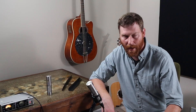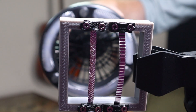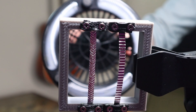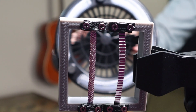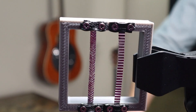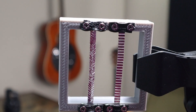The biggest way I can show this to you, I think, is inside of the test frame you saw before — we use these for drop tests. But you can see it most obviously with a fan. I'm going to pull up the frame here. When I put the fan behind it, you can see the regular corrugated ribbon really bowing out and flapping in the wind. Then the herringbone bends out some, but it's much more stable and doesn't deflect nearly as much — it's much more rigid. And these two ribbons are made from the exact same aluminum, cut to the exact same length and stretched to the same length on the frame. The only difference between those two ribbons is how they are corrugated.